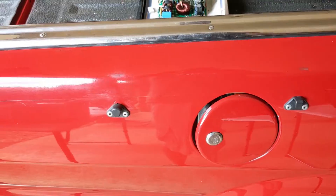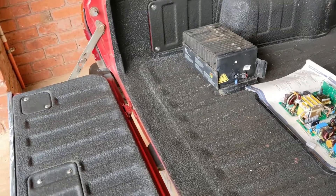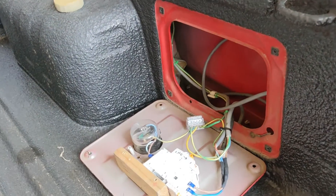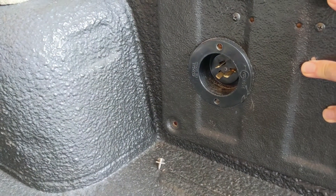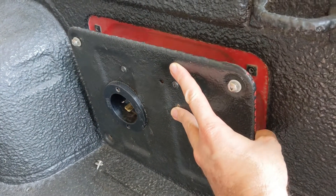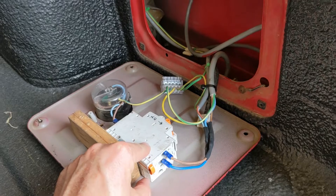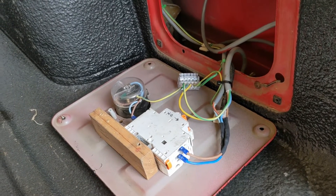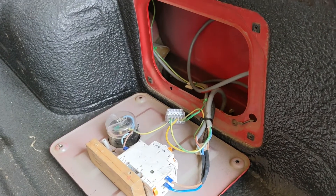When I put in the lead acid charger as well as the TC charger, I could charge with both at the same time and get a faster charging current. So I put a separate AC circuit in here — there's an inlet and I could plug in an extension cord and run both chargers simultaneously. In behind here there are two RCDs; the person who certified the build required RCDs in there, which is fair enough.